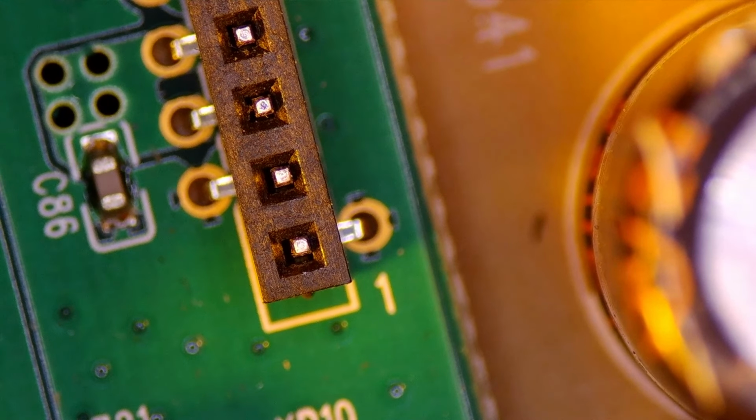Okay. So it looks like we've already found our first issue with the MOSFET on this board. I don't want to go any further because we know power is not reaching any part of the board except for the input of that MOSFET. What I'll do is look up the replacement for this to see if it's possible to get. I don't have high hopes, and I don't have a donor board either, so I don't have any way to pull parts that are known good to fix this one. So I'll do a bit of research and I'll come back when I have a solution.